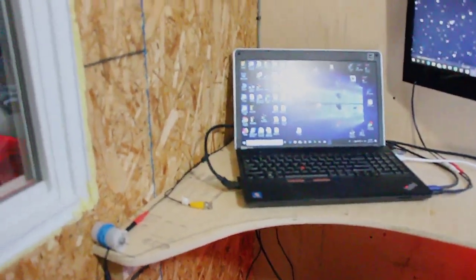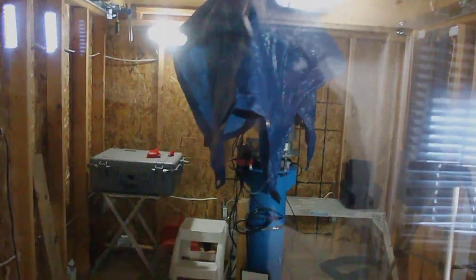But so that's that. The other thing I'd like to point out, got some blinds there, and there's the baby. We're heading in there in a minute. But I went with ground fault interrupters, both circuits. This is the circuit that heads out to the observatory, and there's another one back there. A little dark, but either way, this whole little structure is protected. I wasn't sure about water leaks, and I've had a couple of minor issues, but bottom line, should there be a fault between the ground and the power, this thing could save a life someday. So that's it. We'll head into the observatory section.